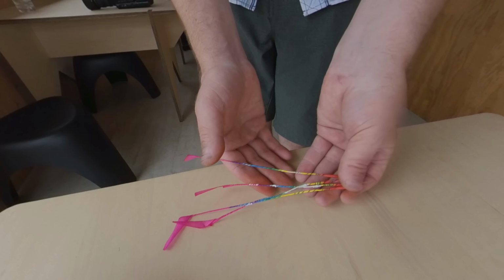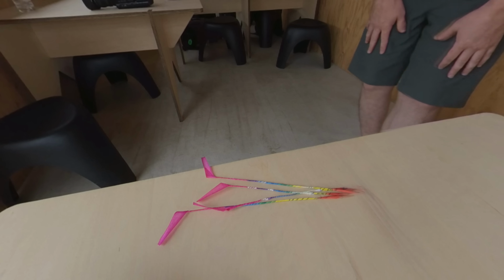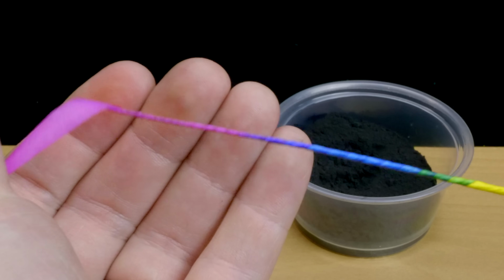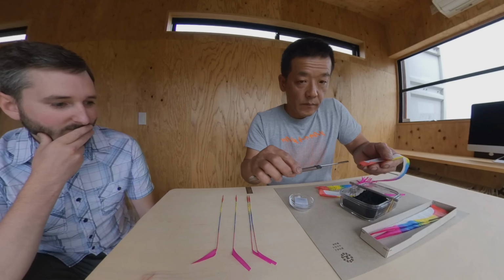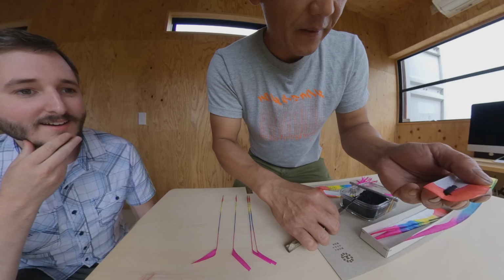These are some of the first sparklers I rolled, and you can see I made many mistakes. The tail of the sparkler is simply a continuation of the body, where it will be held when lit, rolled in the same way as the body, with some left over as a decorative flare. And this one is finished. I've mentioned it already, but during this process, tension and finger placement are key.